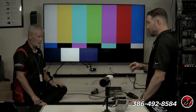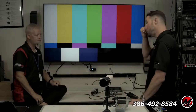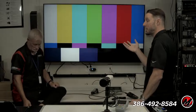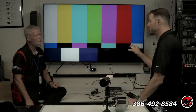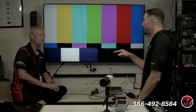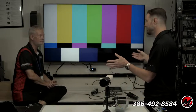Well, and very few people think about their projector versus the screen. It's like, how big can I fit on this wall? And when you look at projector specs, it's always funny because one manufacturer, specifically off the top of my head, says in the specs you can produce a 30 to 300 inch image. So what does everybody try to do? 300 inches, baby. Meanwhile, after about 100 inches, the picture gets so dim it's unwatchable. So you have 100 to 300 inches of unusable picture.